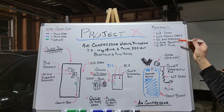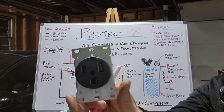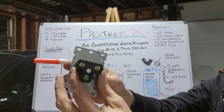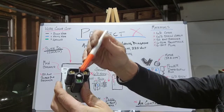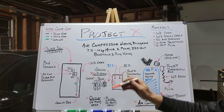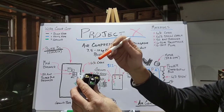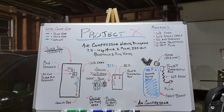This one's for a plug-on neutral load center, so it does not have the pigtail. We'll also require a NEMA 6-50R receptacle, which has three screws on the back with an X, a Y, and a G. The last thing we'll need is the NEMA 6-50P plug, which also has an X, a Y, and a G. Make sure you hook up your black to X, the white to Y on each one, and G for the ground, to ensure proper voltage flow to your equipment.